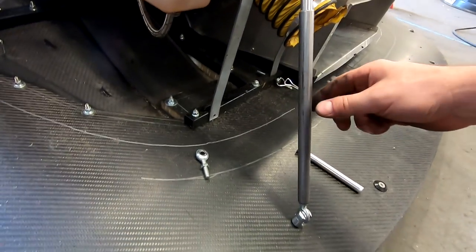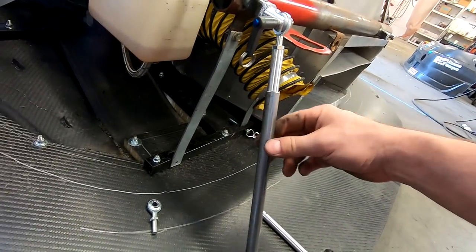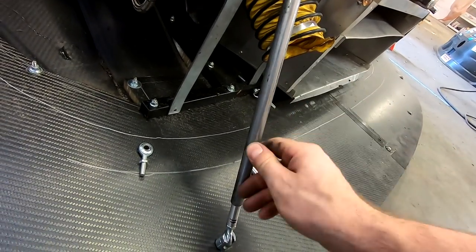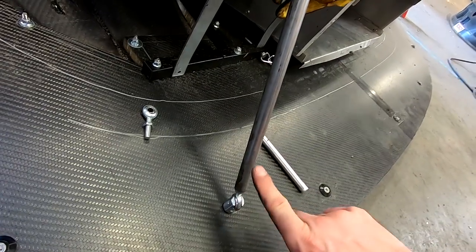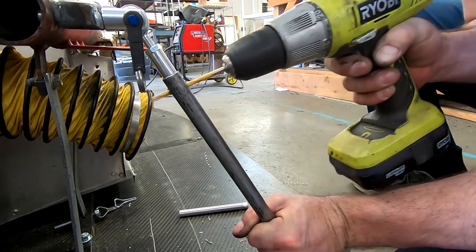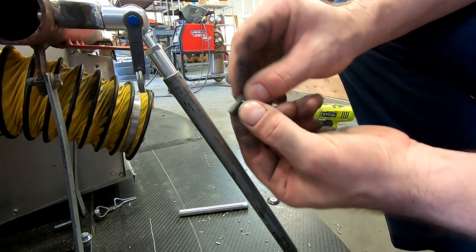Our first initial test fit — this outer sleeve is just over a half inch while the rods are exactly 500 thousandths, so it's snug but not so snug it binds. We want to make it solid on this top half of the rod. On the bottom half we're going to put a tension pin through it and slot the outer sleeve — that slot is what's going to allow this to go upward if it hits something. A tension pin is a little pin with a slot in it that's slightly oversized for the hole, so the tension is what holds it in.